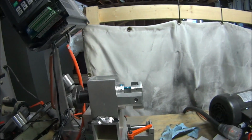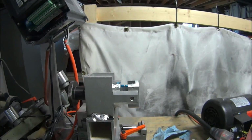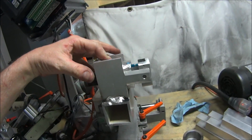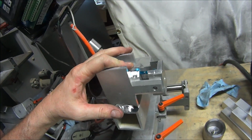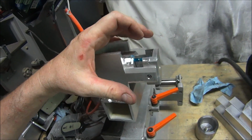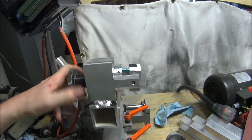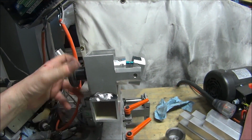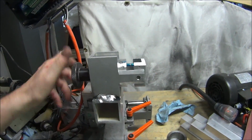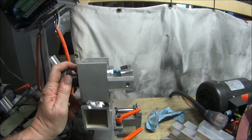Alright, so this is the inside. It's got a set of arms here that hold. I kind of showed this a few days ago in a different video. A little actuator there. I got a slide block. It slides back and forth with this little actuator that is connected to this pivot. So when the block moves forward, the pivot goes, and the wheel's connected to the pivot. When the block pulls back, the wheel pivots the other direction.